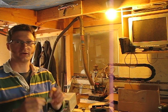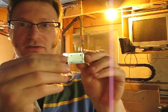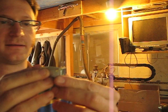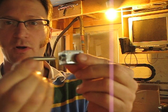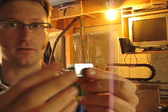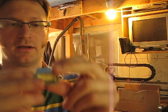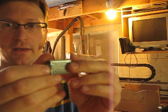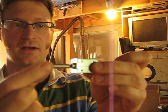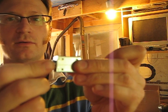A lot of you are probably familiar with solenoids. For those of you who are not, a solenoid is a two-lead electro-mechanical device that allows you to produce a linear motion. You have a little plunger here that you can attach something to — a lever, or whatever you might want. There's a coil inside, and when you put power to that coil, it creates an electromagnetic field inside of the solenoid. The plunger has a large iron content and it will be pulled into the solenoid.